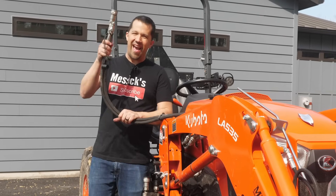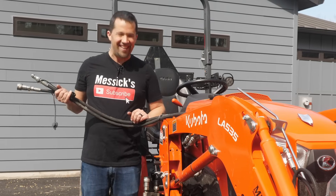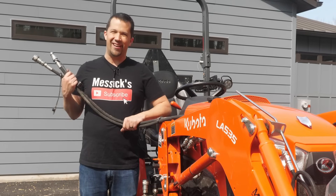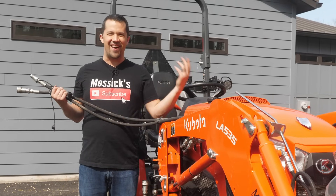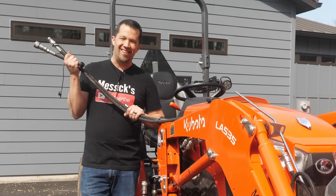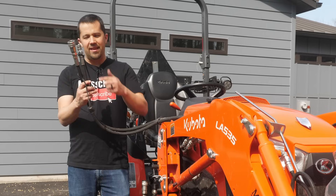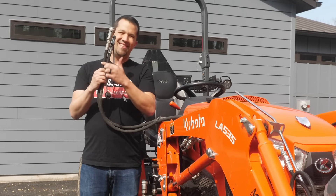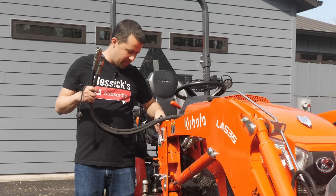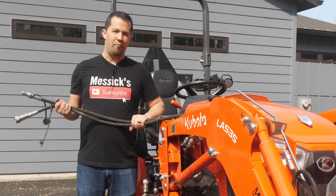The last time I had these hoses connected, it was about 40 degrees outside, and I then unhooked them. I've now let them sit out here on this nice sunny day — it's 72 degrees and sunny outside. These hoses are actually a little bit warm to the touch just because they're black out here with the sun on them. Because of that, we start to get some pressure built up inside of these hoses, enough pressure that I can't overcome when connecting these Pioneer couplers down into this valve manifold.